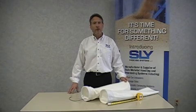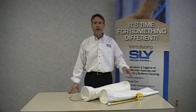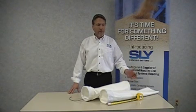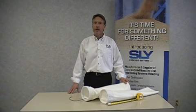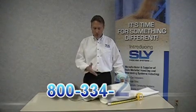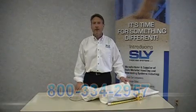Finally, we're going to need to know the filter media that your bags are made of. It could be polyester, an aramid, a Nomex, or fiberglass. If you're not sure what that media is and you don't have any documentation or lost your manuals, send us a bag. We'll do the dimensions, we'll determine what the media is, and quite frankly that would be preferred for us anyway.